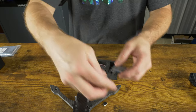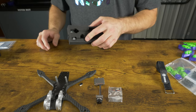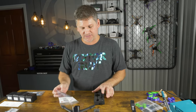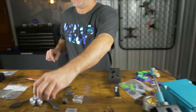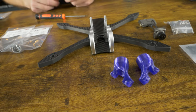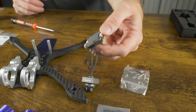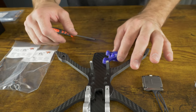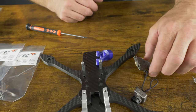We're going to pull out our camera and video transmitter, take out the screws, and set aside the stock antennas — personally I get more range and penetration out of the OCP antennas. This bag of screws is what we use to install our video transmitter. We're going to need these two 3D printed parts to install the OCP antennas — they also act as spacers to space up the Walksnail video transmitter, because both sides are heat sinks and you need airflow to the underside.